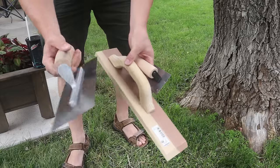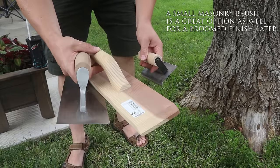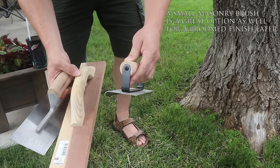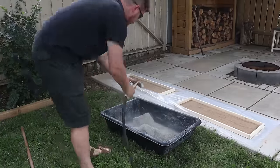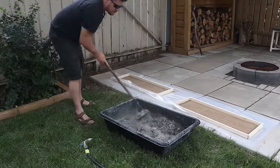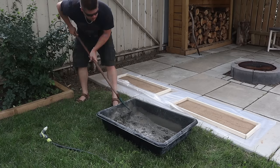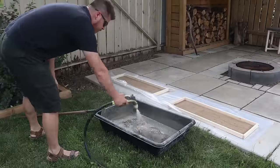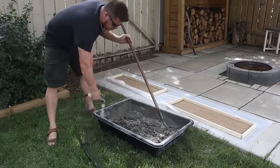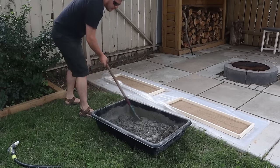Before we start, you'll need a couple of tools from the hardware store: a steel trowel, a wooden float or a 2x4 larger than your form, and a concrete edging tool. Grab a mixing bucket as well — this is a two-bag one. Pour a bag in and mix one at a time, adding water as needed. You're shooting for about pancake batter consistency. It's going to be quite a workout, so get ready. Make sure to scrape all the sides and edges so you don't have any dry spots.